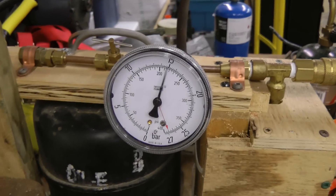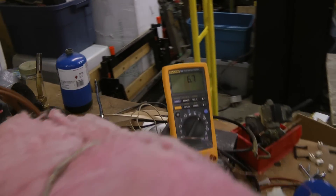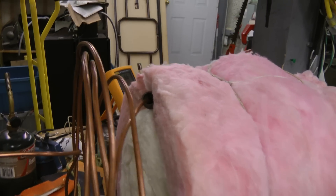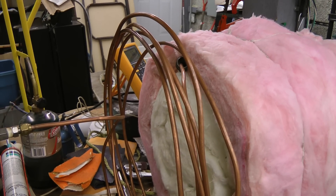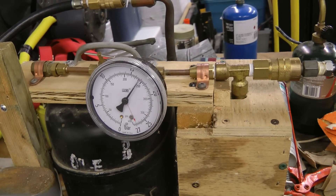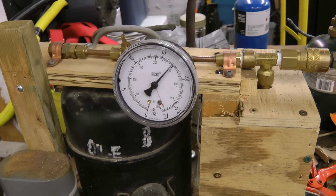The pressure is going up a little bit. I'm wondering if the valve is becoming blocked — we'll have to watch that closely. It's just dropping slowly. I think I'm going to put another garden hose on this to see if that produces any better performance. Pressure is rising further; I'm thinking the valve might be blocking up now, so I'm going to have to terminate this run.